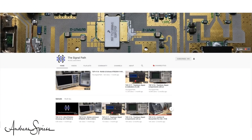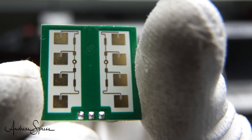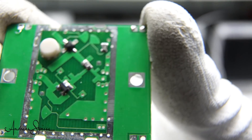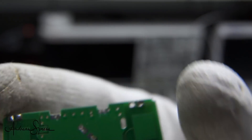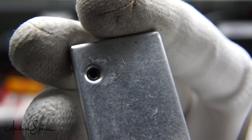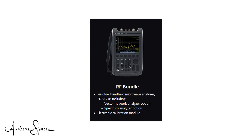If you are interested in this kind of thing, you might be interested in the Signal Path channel — but remember, this is hardcore. On the other side of the PCB we find the antennas: one to transmit and the other for receiving the signal. The HB100 looks similar; its structures are bigger because the wavelength of 10 GHz is also longer. Below a QC sticker we find a small screw, which I assume is part of a capacitor used to adjust the frequency. If one of you wins the RF bundle from Keysight, they can confirm — measuring frequencies up to 26.5 GHz.